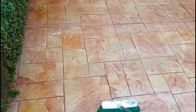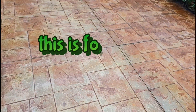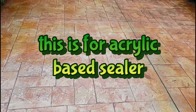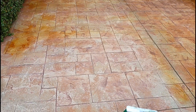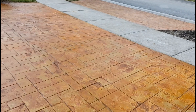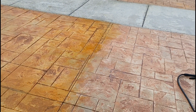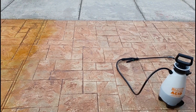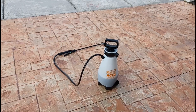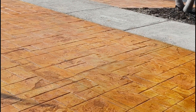Some areas are exposed a little more and stripped back than others. This is an acid etch that will etch and also stain the other areas, giving more of a reddish color - we want more of an orange color. This area to the left has been sprayed, and we'll continue on and spray the area to the right.